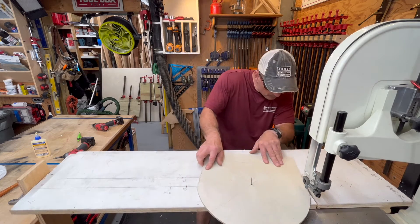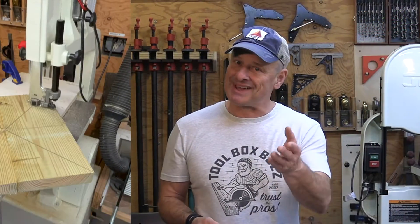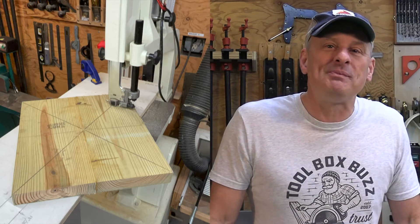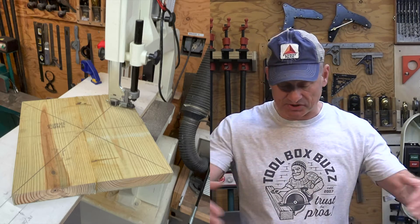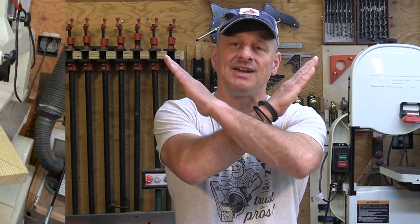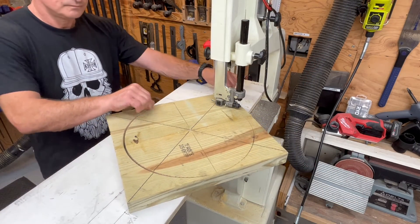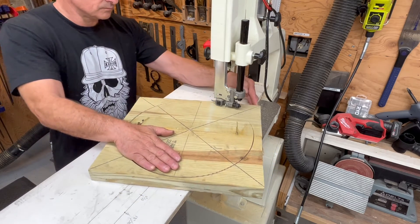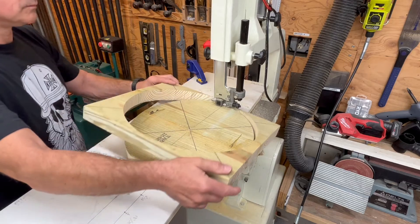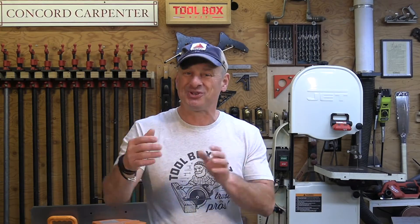This was a quick, cheap fix. Assuming the wood piece is square, I squareed it off once it was glued and clamped, then drew diagonal lines across it in an X to find my center point. At that center point I drilled a small eighth-inch pilot hole, which slides down over the 16-penny nail on the extension table. The edge lines up right with the blade, then you just turn the saw on and slowly rotate the wood clockwise through the blade to cut a perfect circular column base.